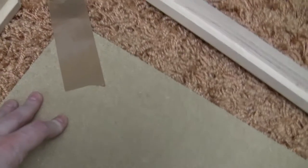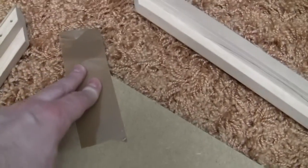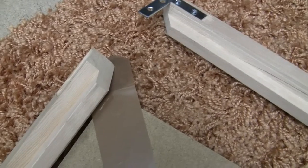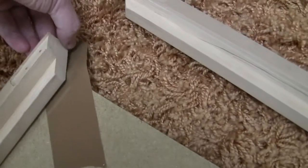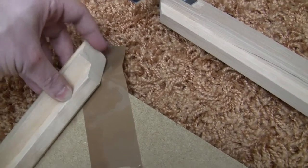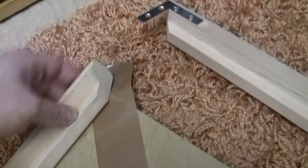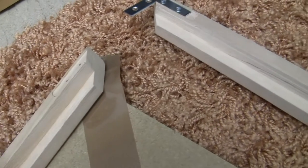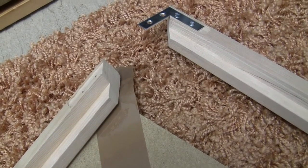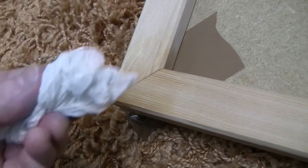I'm going to use the two big boards one on top of the other as a stable base. There's a little bit of parcel tape here to make sure we don't stick to the board and I don't get glue on the carpet. All that remains is to put a little bit of glue on the joints — I'm going to go slightly shy of the front because those corners need to be rounded off later with sandpaper, so I'd rather not have glue there to contend with. Once I've glued it I'll put the screws back in and leave it overnight, then just use a damp paper towel to remove any stray glue.